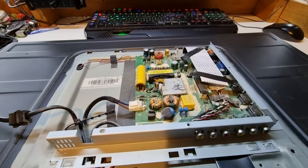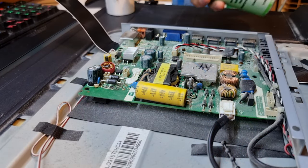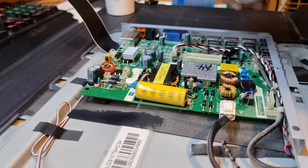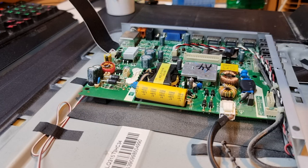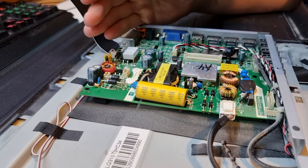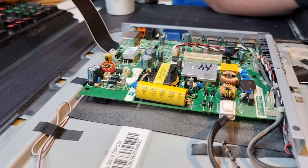I should fire this up and see what the output voltage of the supply is, but first I'll do a bit of looking and analyzing. I've disconnected the display connector — there's a big fat shielded ribbon cable — and I'm using circuit board cleaner to get the dust off without spreading it through my workshop. Now I'm looking for signs of a component that's been hot or failed, or electrolytic capacitors leaking. If anything has gone, it's likely this big filter cap. Sometimes you just have to sit and stare at the board and the obvious problem will jump out.